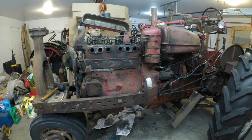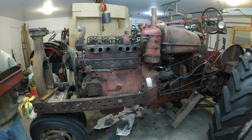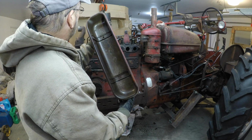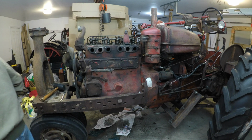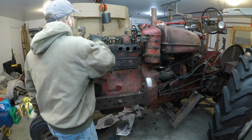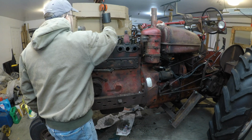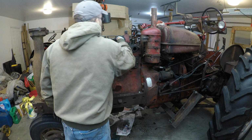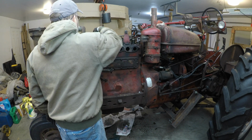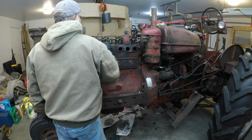That's fairly clean inside. I don't know how long this engine's been running. Looks like there was some corrosion earlier. I think that's deposits actually, now that I'm looking at it. There's little signs of corrosion. That tells me the engine's been running cold a good bit. Around this nut right here, there's a good amount of grease and corrosion. The valve springs are nice and clean. Just the tops of the bolts here that hold the valve train in are corroded. Hopefully I can get that off.